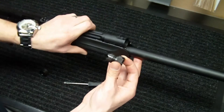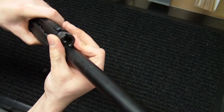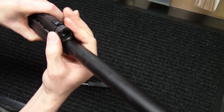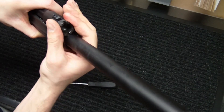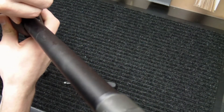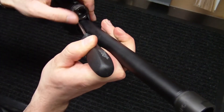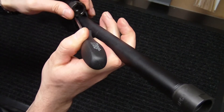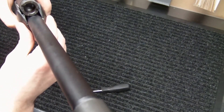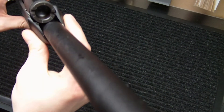To install it, it's pretty much the same thing. Just go ahead and stick it in there and screw it in. This one sticks out a bit further, which is nice. Make sure you get it all the way in. This one actually snaps all the way in, as you can see there. Go ahead and depress that a little bit and continue turning until it's all the way down. And now you're locked in, able to choose the different settings you want for a more fine-tuned gas system.